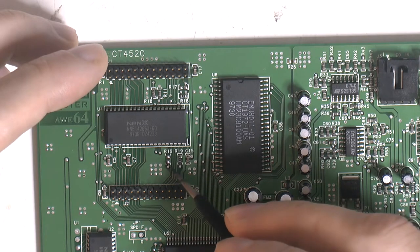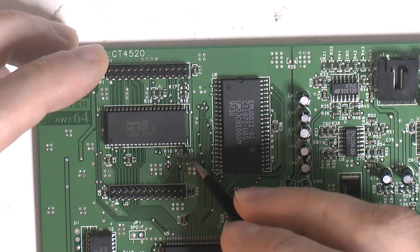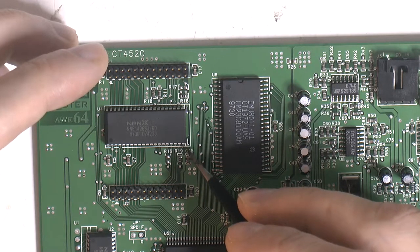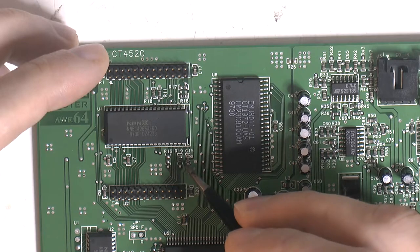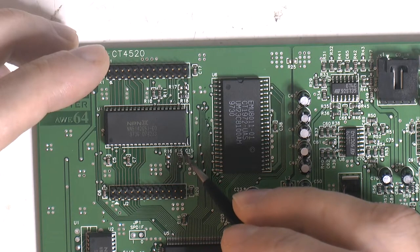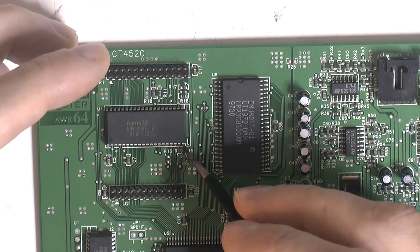So if we move that over here, we remove the 5 volts here. So we've got 5 volts out here that the new chip will use. And this 0 ohm resistor moved over here will reroute the address signal to this pin here. It right now is 5 volts, so we'll build the second one from the corner on the new chip. That's how we get one more address pin.